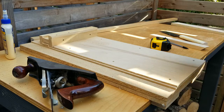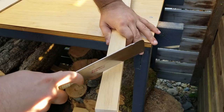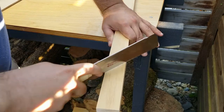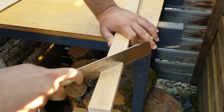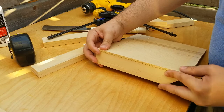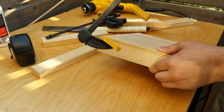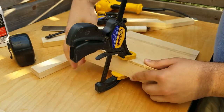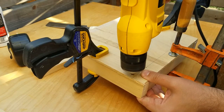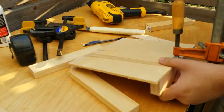Now to shoot angled miters or boards, I need to create a jig that will hold a piece at about a 45-degree angle. I took my time cutting these out by hand and trying to get them as close to 45 degrees as possible. Then I made a frame around the top of the board and glued and screwed all three sides. After pre-drilling, I put the screw partially in and then used the tip of the screw as a guide to get the pieces back together into those pre-drilled holes.